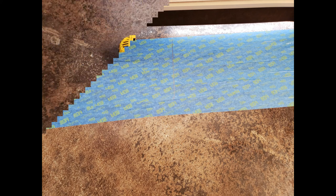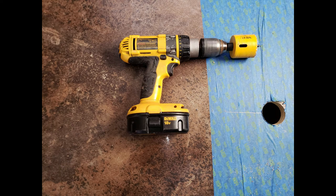The tape was to prevent damage to the tabletop during the drilling procedure. Once I determined where the location of the wire grommet would be, I cut the hole in the table using a two-inch hole saw mounted on my cordless drill.